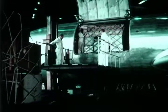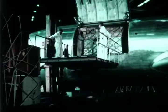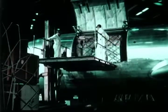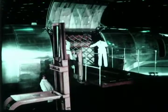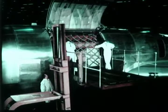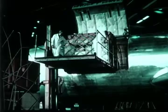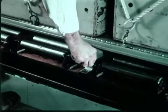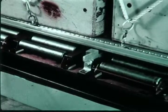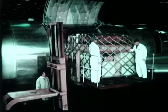The staging is raised, leveled with the aircraft, and quickly adjusted to the changing level of the airplane. Use of the forklift also permits easy adjustment of the staging to conform to changes in the level of the aircraft floor as the pallet is moved out. Manpower alone is sufficient to move pallets at safe speeds. Simple and easily operated stops hold the pallet in position on the roller conveyor section of the staging, and side railings contribute to personnel safety.